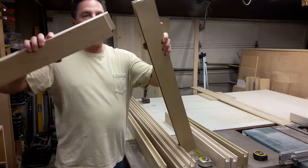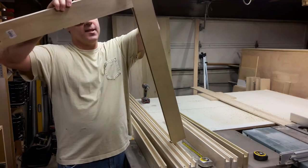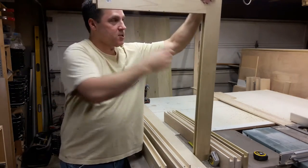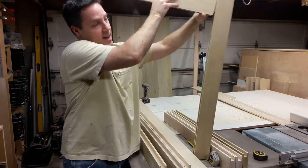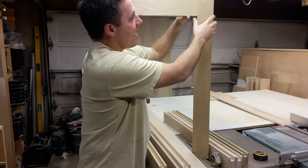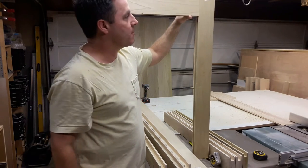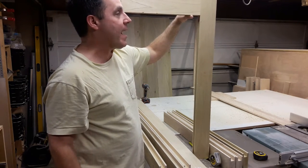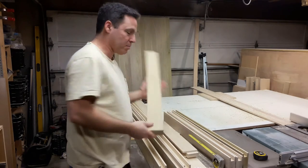Once you do that, you can see how this essentially fits together just like this, and the door will fit in here into this slot. You'll glue these things together, and where these two intercept, after the glue, I'm going to put a few pin nails in here just to make sure that nothing is going to move while the glue sets up to dry. So that's the last thing that we have to do at this point.